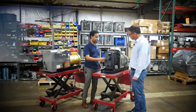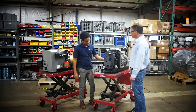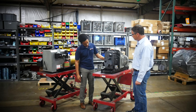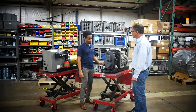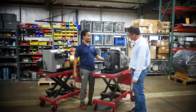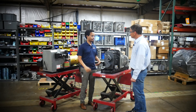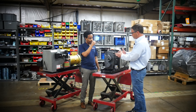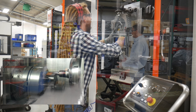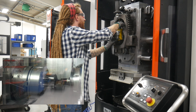That continuous motion causes the inlet to have suction. It looks like they're touching, but they're not — there's a few thousandths of an inch all along this profile. That's actually one of the hardest things about this pump to manufacture, because rolling contact is not allowed — you'll have a crash. These counter-rotate and even at full thermal growth they're not touching. It's pretty high precision machining; we spent seven years in development.